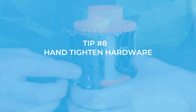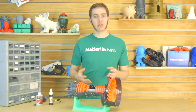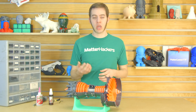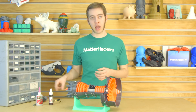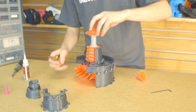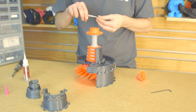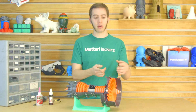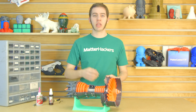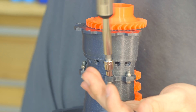Screw on nuts and bolts by hand before you start using a tool. This is just going to make it easier to assemble because you don't have to try and wedge in a bunch of tools. I usually will take a set of pliers, hold the nut and thread it if it's in a hard to reach spot, and then spin it by hand with just a finger. And for sections where it's a lot easier to reach, I'll just hold it with my finger, screw the other side with the wrench, and then once it's getting close to bottoming out, use tools to hold it in place and make sure it screws on tightly.